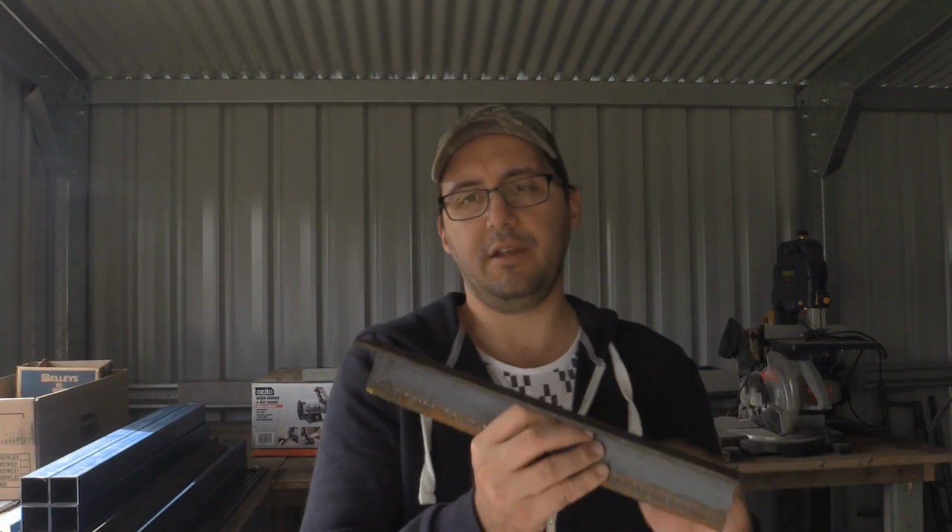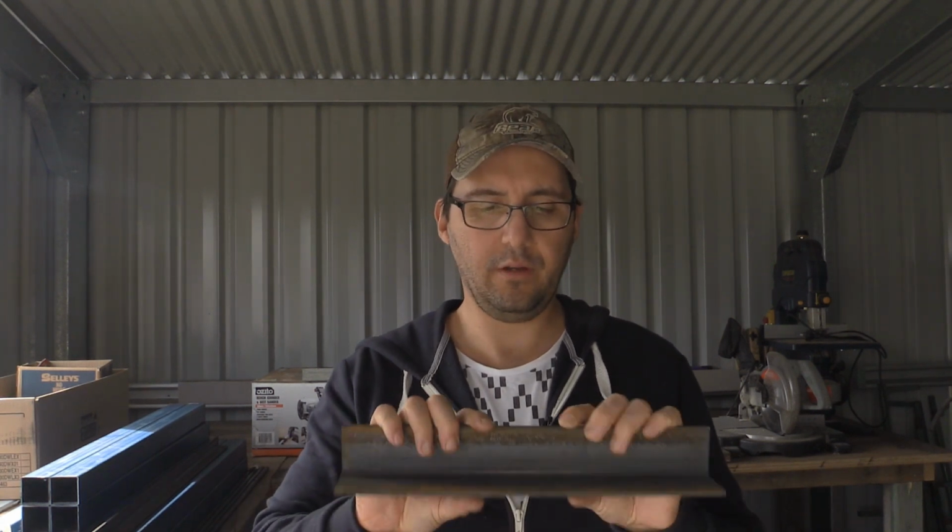So that's about it with the steel side of things. What we've got here, we'll look at getting the plasma cutter out shortly, get the compressor fired up, and we might do a bit of testing. All the testing will be used in the cutting of certain brackets and so forth. For example, this is going to be a good test. This is my 5mm angle, and it needs to be cut in half, so we'll look at marking it up, and we'll see how well the plasma cutter goes cutting this in half, getting it ready for the Y gantry angles. And then I've also got to look at cutting this 5mm plate as well, so we'll look at using the plasma cutter to do some cutting, and we'll see what sort of accuracy we can get from the cutter, how wide our cut line's going to be, or the kerf, and we'll see how much dross is left on the back of this steel, and how easy it cuts. So let's get to it.